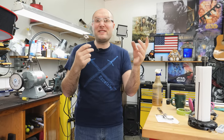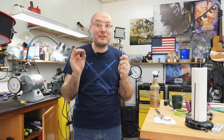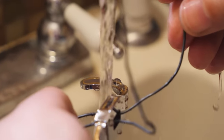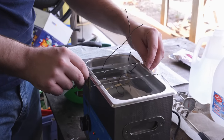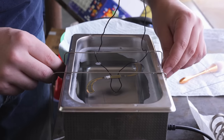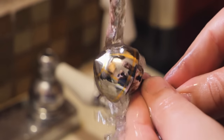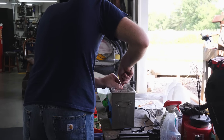It's finally time to finish all of the fittings by gun bluing them. We're going to do a controlled form of rust gun bluing — putting them in caustic salts at about 290 degrees, which is going to form a layer of black oxidation. Hopefully it'll come out perfectly the first time. The number one key to gun bluing is getting your parts nice and clean. If you have any oil residues on there, you'll end up with some really weird colorful spots on your finished part, and we don't want any colorful spots — we want a nice, even black finish everywhere. So I clean everything in Dawn dish soap first, then move on to an ultrasonic cleaner with a chemical cleaner, which really helps make sure I don't have any oil residues.